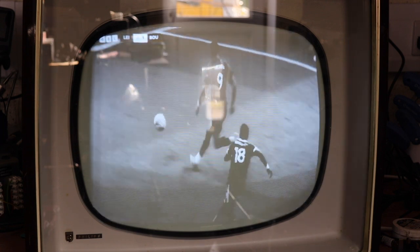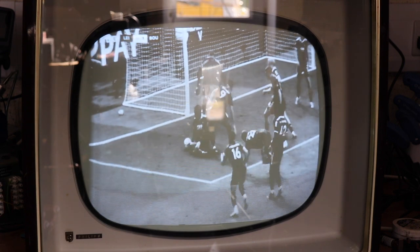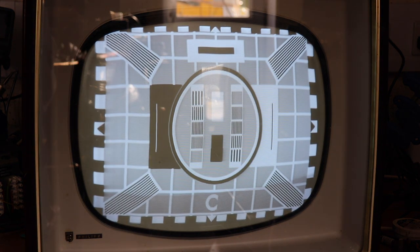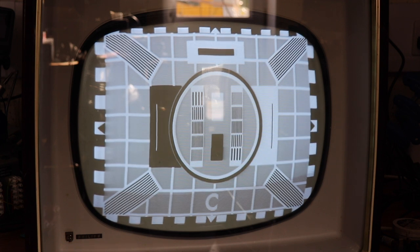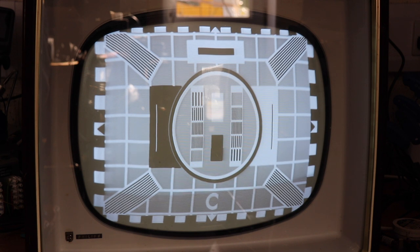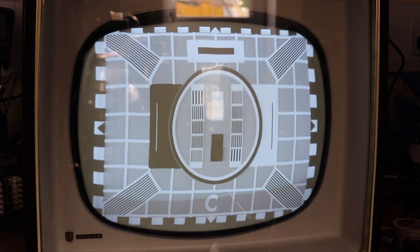I could go through a whole load of channels on this, but you get the gist. Let's put it off for a minute and go back to the test card. So there we are — that's the 405-line Philips 17 GT100, and I think you'd agree it's not a bad picture for a 60-year-old television. What we'll do in the next video, I'll show you how I rewound the line output transformer, because if you've got an old television with one of those faulty, that can often be a game stopper. So we'll have a look at that next time. Thanks for watching and hope to catch you all again soon.